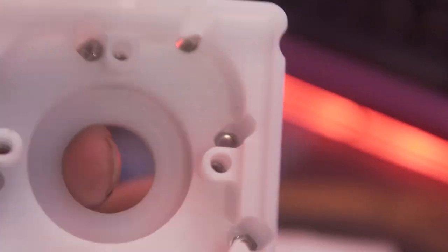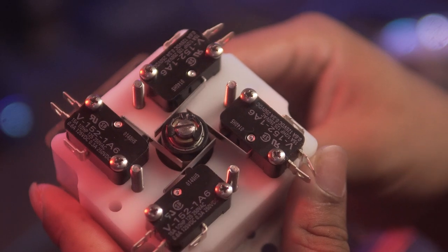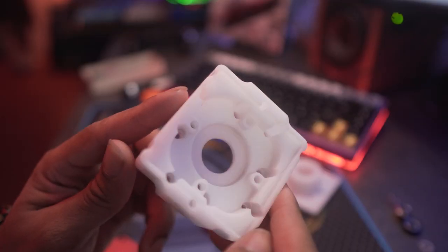Looking a little more inside, you will notice the cutouts for nuts that sit inside the body to hold the switches in place. This can be a pain in the ass sometimes, since when you're trying to screw your switch back into place, the nut can turn sideways and may wedge itself in the body enough where you're gonna have to take it entirely apart. Pain in the ass, but it actually serves a purpose.